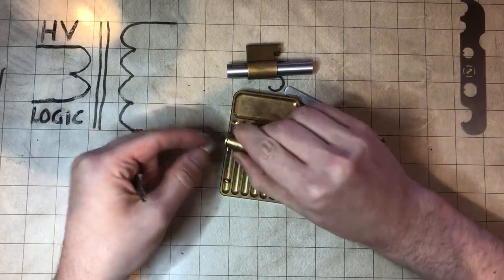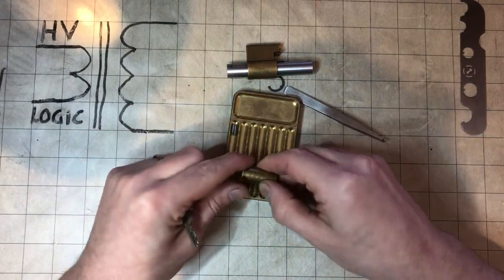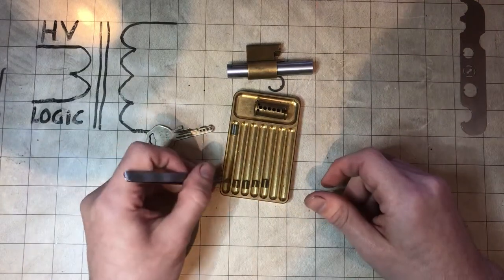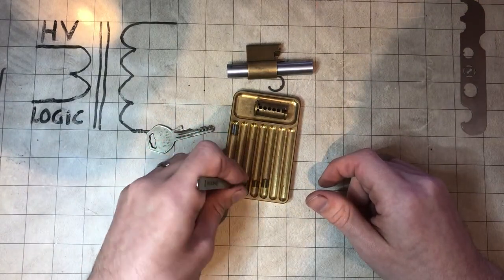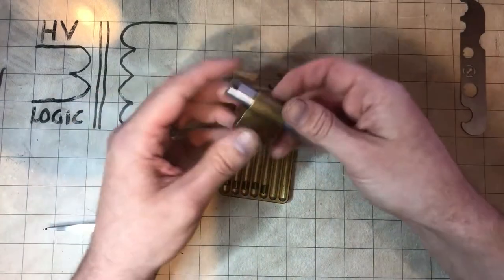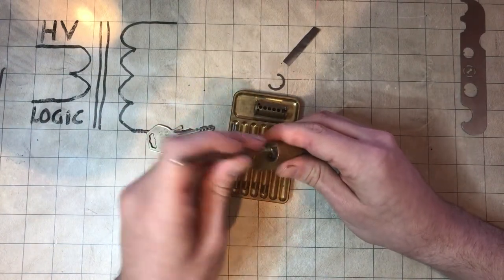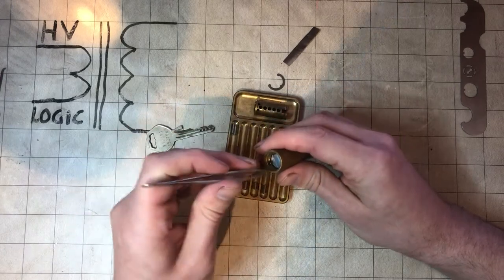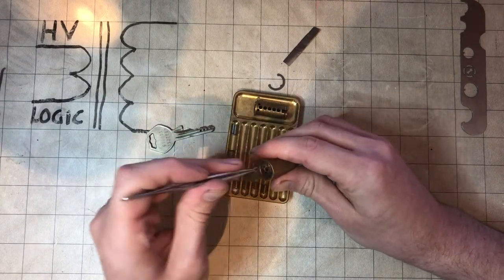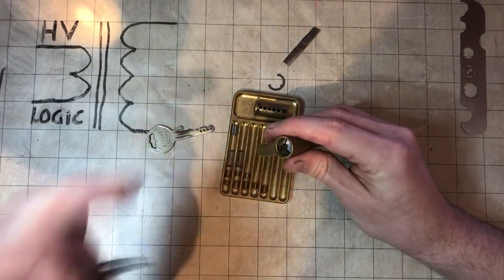One drill protection rods. They're not very exciting. There's some more in the back. 3, 4, and 5. Yeah, we'll come back to that. Let's just roll upside down. 2, 3, 4, 5. So all, you know, somewhat boring standard key pins. Get the drivers out, show you those, and then I'll show you the cool rotor. So we've got this nice serrated pin on one. Two, it's like a serrated T-pin. Three, this is a standard, looks like a steel pin.